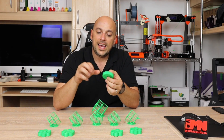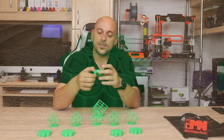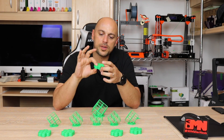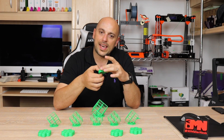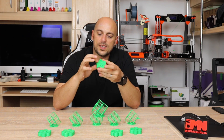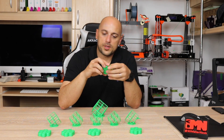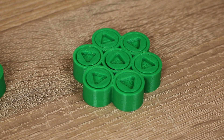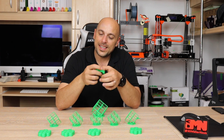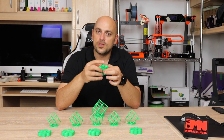At 50% things changed again: 0.4 was free, but 0.3 was fused slightly and took a bit of force to get loose — you could feel it grinding more than the other two. So in terms of tolerances, 50% actually worked much worse than it did with overhangs. At 25%, the 0.5 started feeling a bit grindy in the center, 0.4 was also free but grindy, and 0.3 was tight — it actually stopped turning. Obviously 0.2 did not happen.